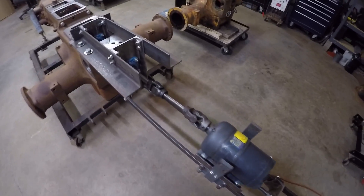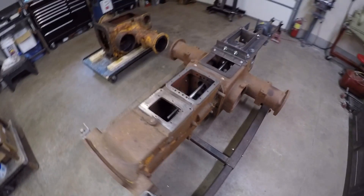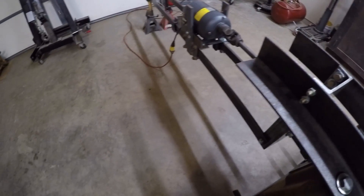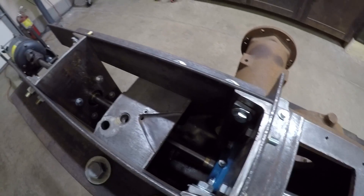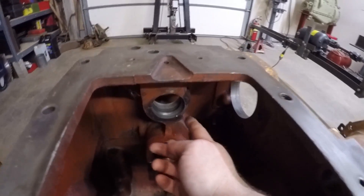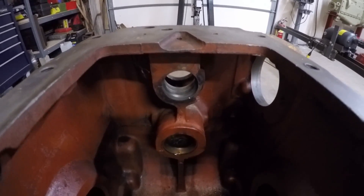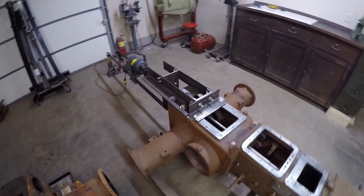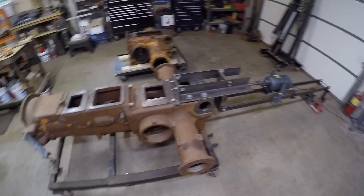That's the full rundown on the boring bar and the drive and feed mechanism that we put together to do the machining in the back end of this rear end to get that bearing bore back in shape. It was a whole lot of work - what little free time I had the last week and a half pretty much went into getting all these pieces cut and drilled and fitted, and getting everything tied in with that motor and track system. But I think we have a workable setup now and we're right at the point where we're ready to start putting cutter bits on the boring bar and starting to make chips. We also have the production 445 rear end here as a guide - you can see a lot of material was milled away even on the production rear ends to make clearance for that belt pulley gear and drive mechanism, so we can use this as a pattern to try and get the prototype fixed up more like the production piece was. Guys, as always, thanks for watching - hit the like button, please subscribe to the channel, leave comments and let me know what you're thinking. We'll catch you later.